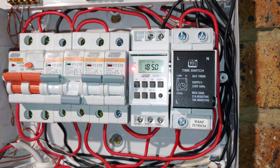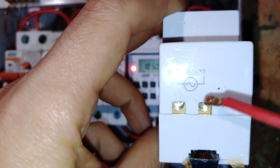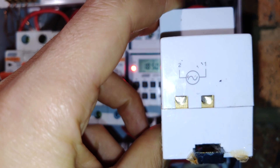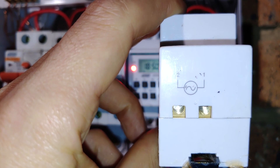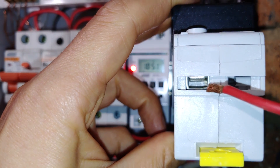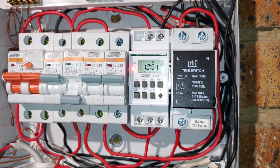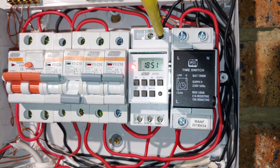Compared to the DIN rail one, which requires a much smaller screwdriver, and the slot where you put the wire is also quite a lot smaller. For example, the MTD8 just fits the conductor for a current carrying capacity of 20 amps, while the CBI version has a much larger area. I generally find the CBI easier to work with, as it uses the same screwdriver size that fits circuit breakers, while that screwdriver does not fit the MTD8 slot.